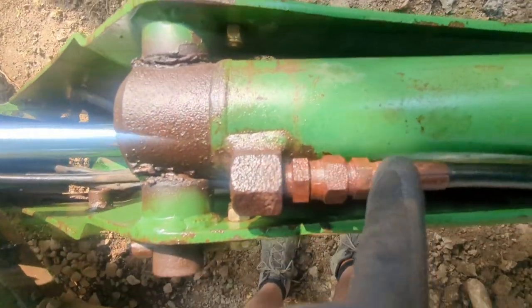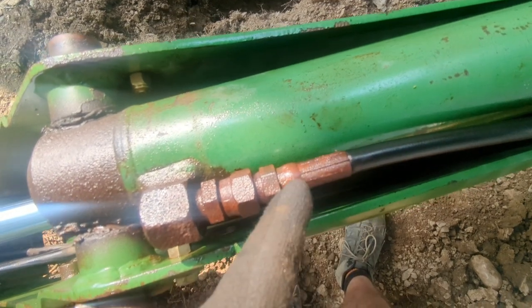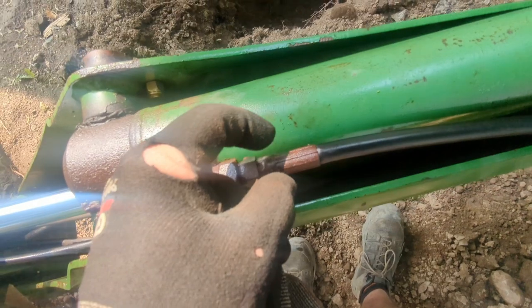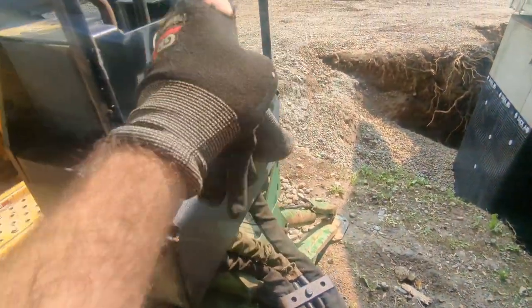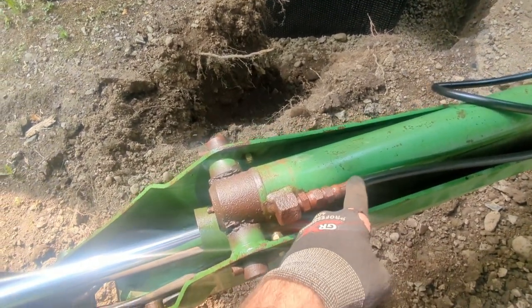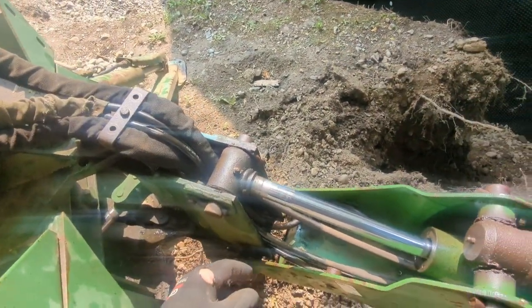These are all like an older style end too, by the way. First thing somebody wanted to do was put a Gates manufacturer end on here, and the collar where it's crimped is so much thicker, and it's considered an improvement for a lot. But when I get under here, you'll see that they're so tightly packed to get to the control valves that you can't have a big body in this area of the hose, or they won't be able to thread in between the other two.